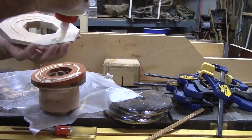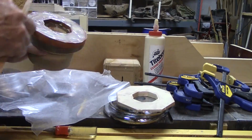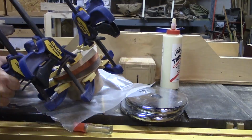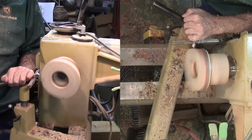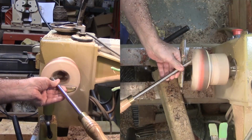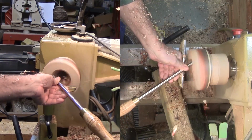Next, an 8-segment ring of oak, again aligning the thin side but still with a little offset so that the glue joints don't line up. Clamping is getting even more weird. Back to the lathe for a trim. This time there will be a change in ring diameter for the next ring. It's really hard for me to visualize the shape and how to optimize the ring placement, so this time I'll clean out the inside before it gets too deep.